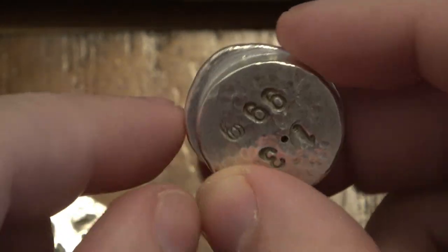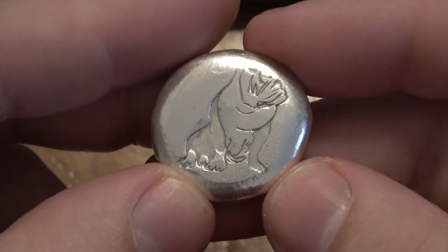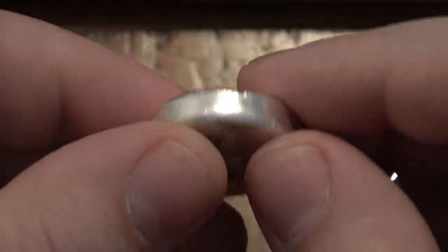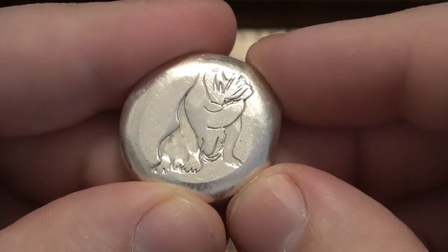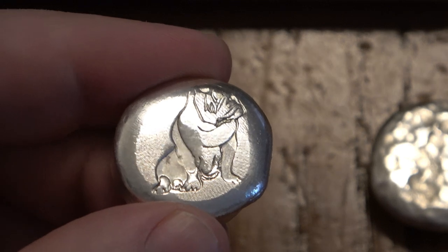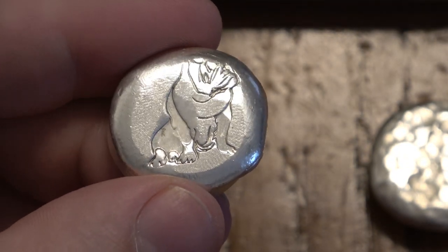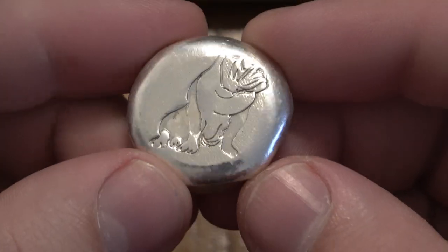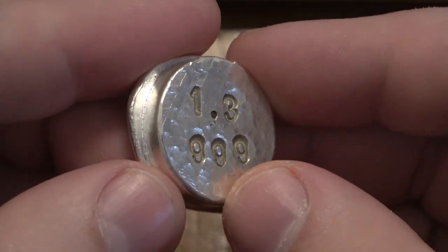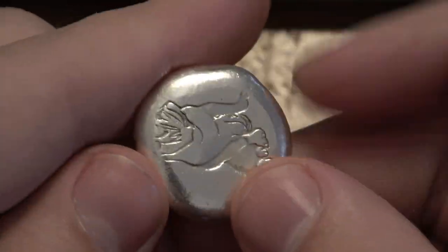This piece went over the mold, so we have a mushroom cap - looks kind of like a mushed bullet. Not the worst thing, but certainly not something I really like. The Gus stamp I love, but the problem is I stamped it on the round part. If I had a much larger, wider area it would have come out much better - a little space is cut off where it's rounded. I hit it with a sledgehammer on a vise, but without a press it's hard to get a perfect strike. I put it in the vise and squeezed to try to get more detail. This one is also 1.3 ounces, 999 fine.